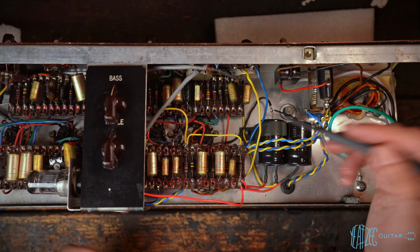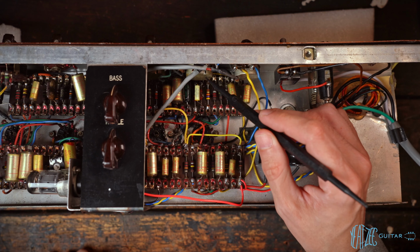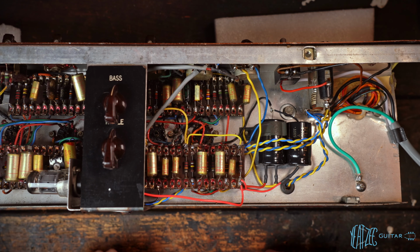All right, I did a recording just now with the 0.0022 microfarad cap in parallel with the 500 picofarad cap for the Brilliant channel. And initial thoughts, it sounds great. Definitely added in or allows more lows to come through and took off some of the super sharp top end. Really, yeah, it sounded great. Now, the settings I had it at, obviously I knew this was going to be the case, is once you make a change, the settings are no longer maybe ideal after the change.